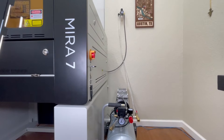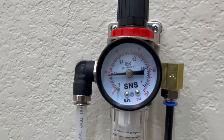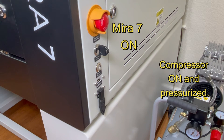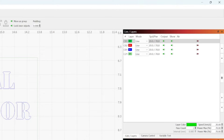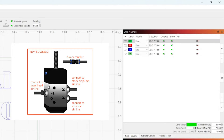I like the modifications I made — the hoses and parts are now out of the way and I feel safe walking around the compressor. The compressor is holding a pressure of 90 PSI, and the gauge on the regulator reads about 27 PSI; I later adjusted it to 30 PSI. It's now time to turn on the Mira 7 and do a side-by-side test cut. I loaded a piece of 1/8-inch unmasked maple plywood and sent this file to the laser. In the cuts and layers window, the air assist is toggled off on each cut process — but this may be a little misleading, because just because it's turned off doesn't mean there will be no air blowing out of the nozzle.